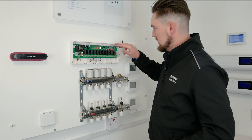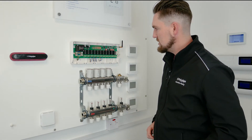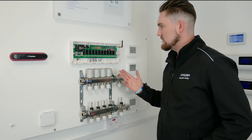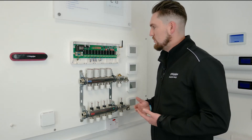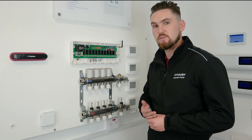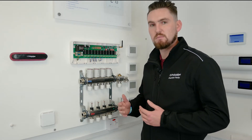As we look here, we can see where it says channel number — we've got two little squares with a circle in, with numbers on. The reason we've got a channel number is if we've got multiple manifolds on a zone, we need to make sure that each wiring center for each manifold has a unique frequency, so we're not pairing stats to the wrong wiring center.